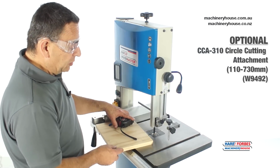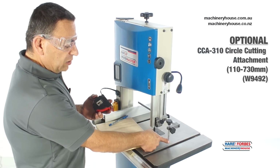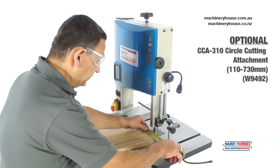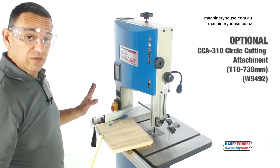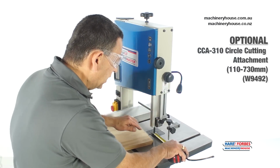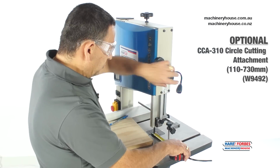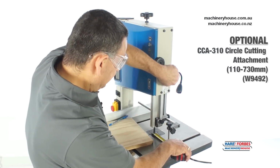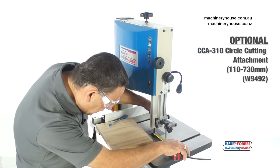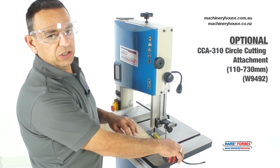Now the first thing we need to do is measure our center distance, and that is simply by measuring from the blade to your center point, and because we're doing 200mm, we only need 100mm. Now always the machine must be turned off when doing this. So here we go, we come across here, and as you can see at the moment I've got 125, so we want to reduce that down to 100, and that's undoing the locking nut, sliding the mechanism till it gets to 100, locking it away.